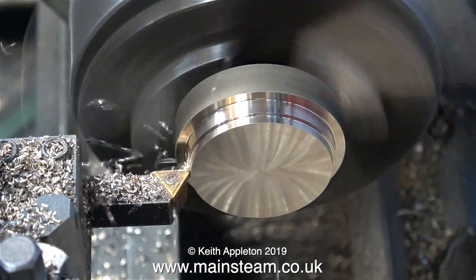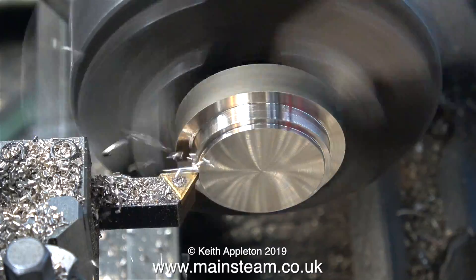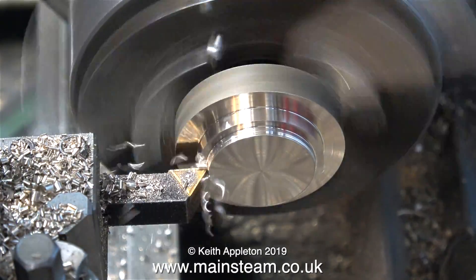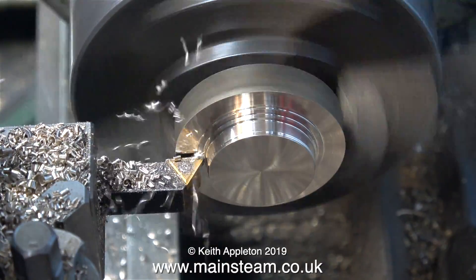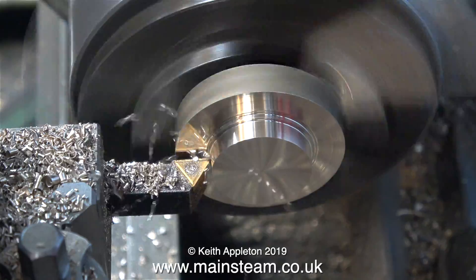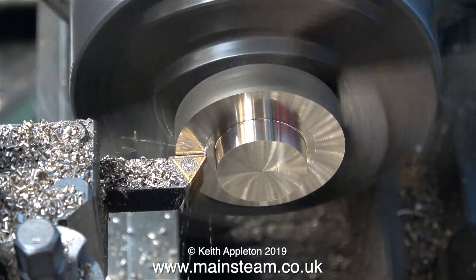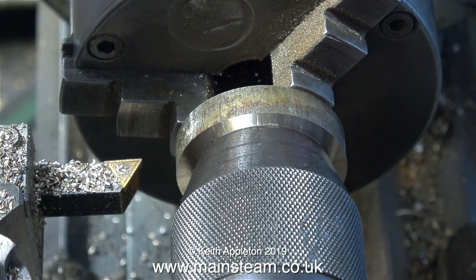Because these videos are tutorials for beginners, generally these days I work most of the time on the Boxford lathe. So much so, I think I'm going to sell my Smart & Brown Model 1024. The only trouble with the Boxford is it's much smaller, and I get used to taking very large cuts from working on the Smart & Brown lathe, which is much bigger and more robust. You can hear the tool dancing about because it's not as rigid as the Smart & Brown. If anyone's watching this and wants to buy a Smart & Brown Model 1024 lathe, please email me via the website — please be aware, I cannot post it. This Smart & Brown lathe is a tool room lathe, so it has a very wide bed and a 6-inch centre height, so it will swing a piece of metal up to 12 inches in diameter.